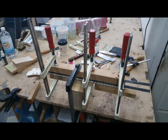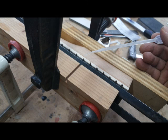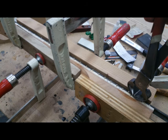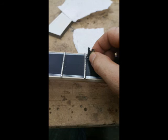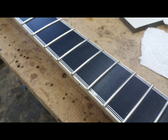This is a process I picked up along the years. What I do is use a couple pieces of angle iron, and I'll clamp the frets down really hard with this angle iron, then run a bead of glue from the side to glue the frets into place. If you do it right, there's not that much cleanup. This clamping and gluing method creates some really clean fretwork — all the frets are very well seated, pretty even, and that definitely helps later on during the setup work when you level the frets out.